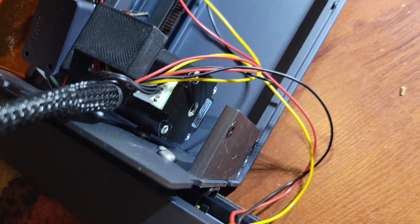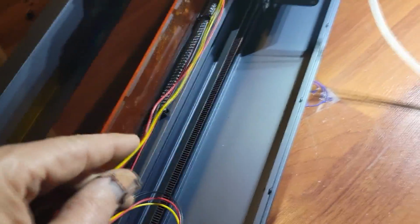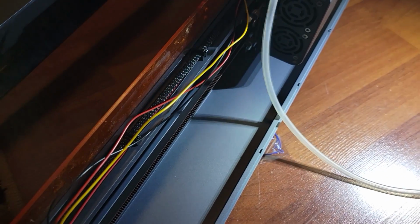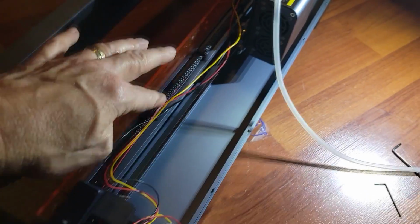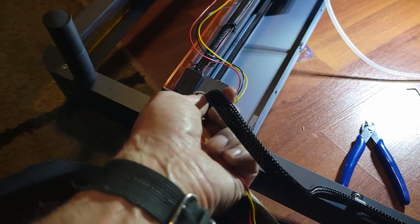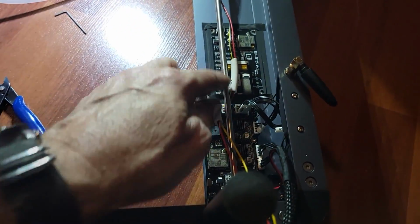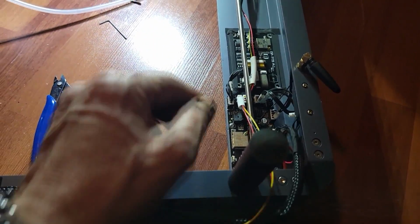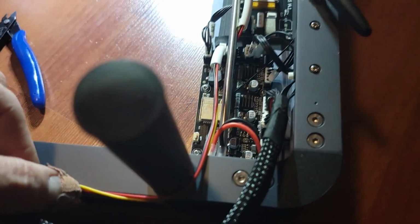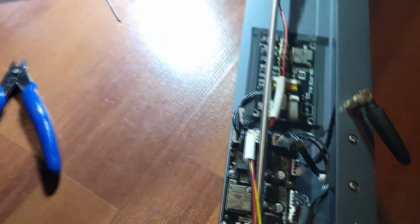So now what we have to do is do some cable management here and bundle all these wires together, because obviously you don't want these wires getting into all these wires. See how they're loose? So what we'll do is we'll zip strap them to these bundled wires, making sure we don't zip strap it to the one that moves with the laser. So all of the fixed cabling will get moved here. And then this will follow the path along with this one, and I'll just zip strap these to this as it goes around and into the main board here on this side of the shaft. So we'll just make sure that that's not hanging onto the shaft, that it's being pulled around this post here, and same with here. And then that way this shaft is free to move, because that's what's moving the gantry over here.